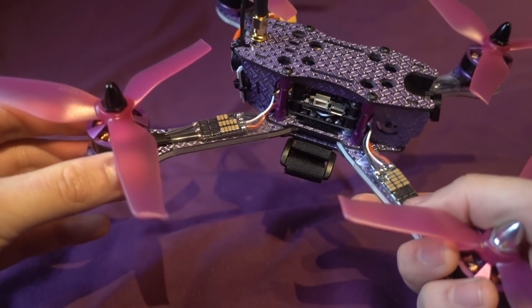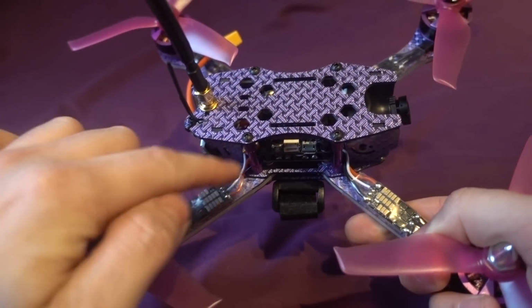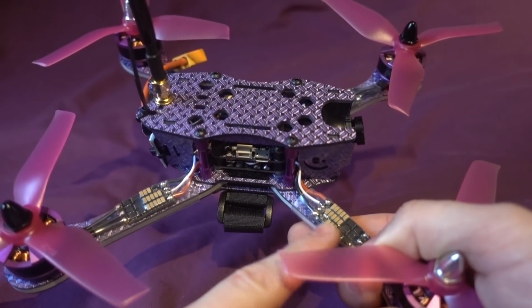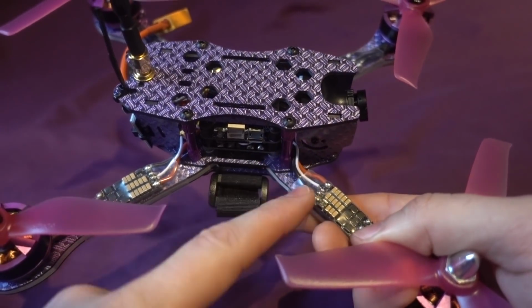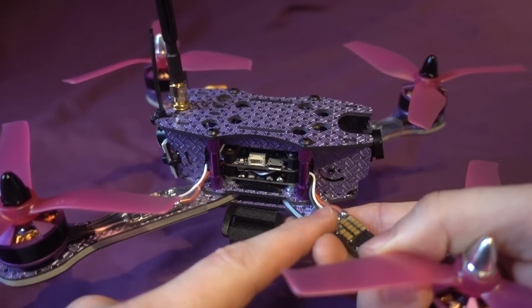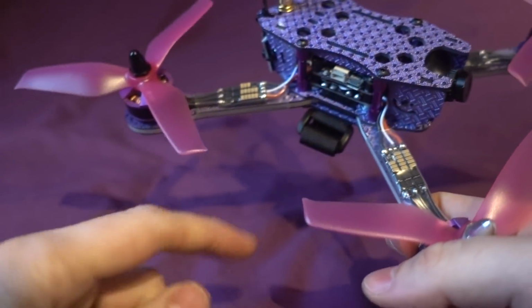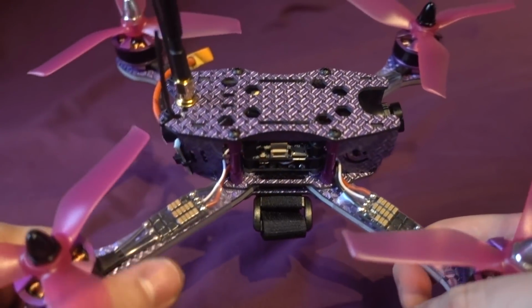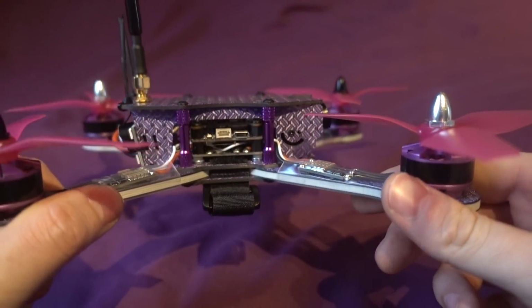And yeah, unusual design compared to recent models that I've seen, because the ESCs, you can see they're individual ESCs, and they are only 25 amp. They are flashed with BLS, however, for some reason, I don't know why, maybe it is the component choice, but they are only running Multishot. They will not boot up in DShot, so bit of a downside there, unfortunately.